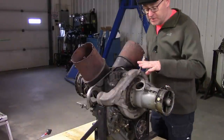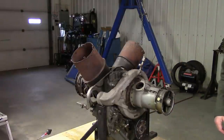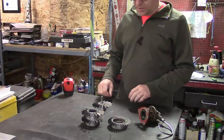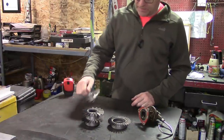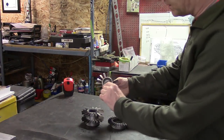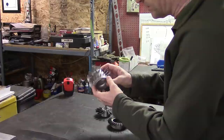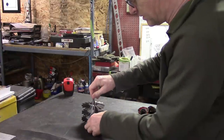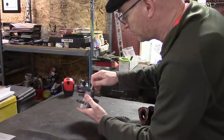If we're not going to take this apart — probably not — we're going to clean it as much as we can. But we don't need to disassemble it because we have some parts here. Back in the day when I was at BCIT — the British Columbia Institute of Technology — training on that engine, they were scrapping some beautiful parts. They've all been glass-beaded to a shiny, shimmering, satin finish. What we have is the first stage of the compressor — I think it's a C18. It's a dual blisk: the spacers, discs, and blades all one piece. It's scrapped because it's got some FOD, some corrosion.